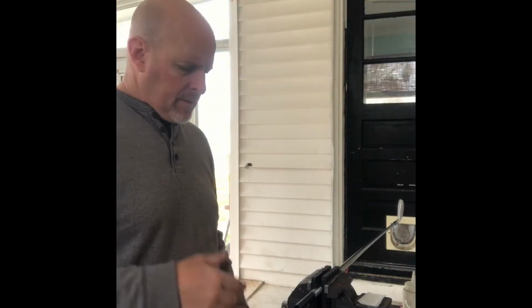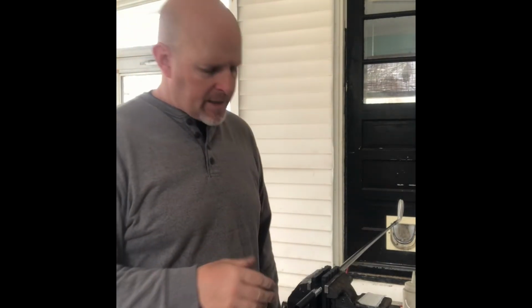The other thing I find, again for the transparency side of everything, is that the extensions they make are really hard plastic. If you use a cutoff saw, something with a grit end like a metal cutoff wheel, the only downside is that if you then go to cut some graphite, the plastic will burn itself into the edge of the cutting wheel. That makes the next thing you try to cut, unless it's steel, very difficult, and it can burn through a graphite shaft. It just makes the whole process more difficult. You can heat it up a lot, and that's not really worth it. It's meant to cut, not to burn through something.